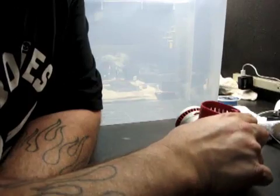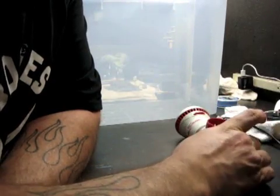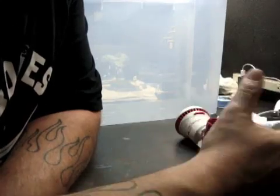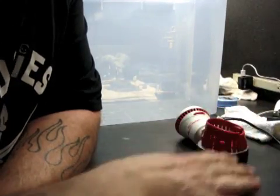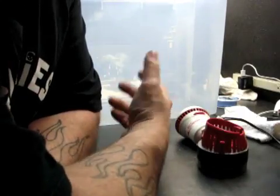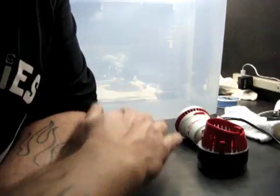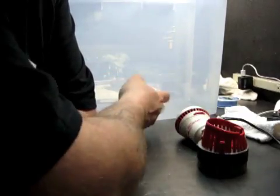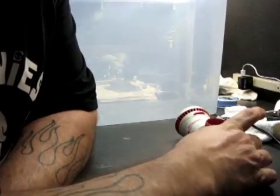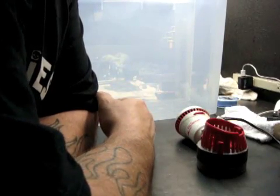It'll let my pump have some weight so that it stays secure and not flopping around, and it'll also get the pump off the very bottom in case there's any kind of chips or crud. I know there will be eventually as the stuff settles down. It'll kind of have a film on the bottom of this container, and this will keep fresh coolant hopefully to the pump. So that's what I'm about to do.